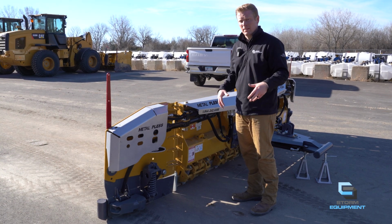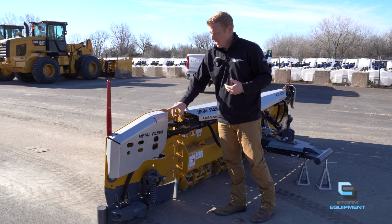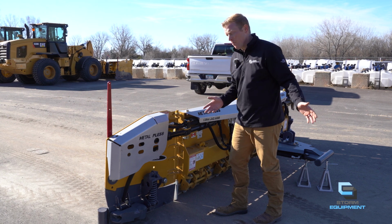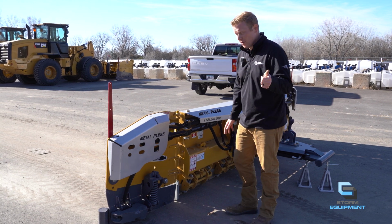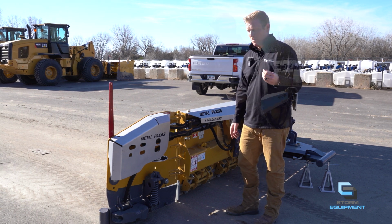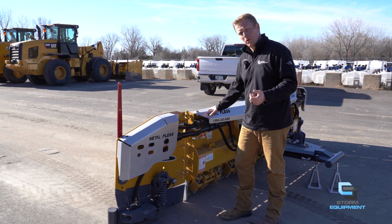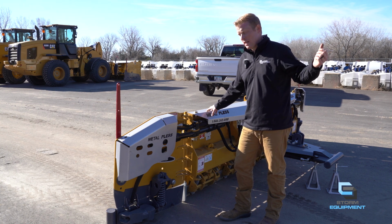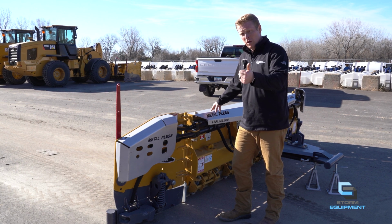Now on the back of the Agrimaxx, a very important option that we order all of our Agrimaxxes with is the tire savers. You have this protective plate on the wing so that if you have your moldboard angled all the way and you have the wing open, the tire hits this and not your plow. Also on Agrimaxxes, something that is very important is the optional equipment. Along with the tire saver, we want the DVD-E3. For an Agrimaxx, if you order this plow without the DVD-E, you will need 4 hydraulic remotes that will run from the back of your tractor under the belly along the undercarriage to this plow. 4 remotes for 4 functions: raise and lower of the plow, moldboard angle, left wing, right wing.